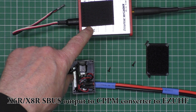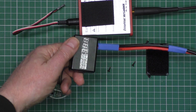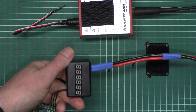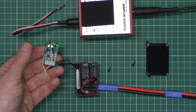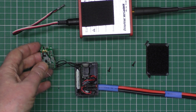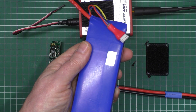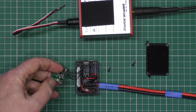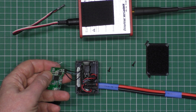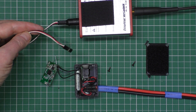The Easy UHF needs 12V and this thing needs 5V, that's why I've got the BEC in there. And that's why I've got the LED displays on there, so I can just monitor the voltage. If you want it to be crude: all you do is get a BEC, plug it into your 12V to power this, then take the SBUS output, feed it through a CPPM converter, and take the output and wire it directly to that. Hopefully that's made more sense.